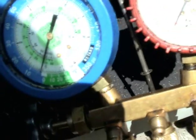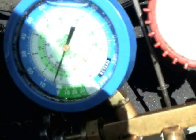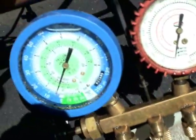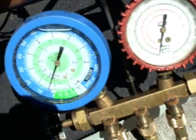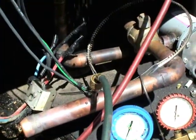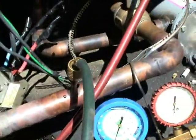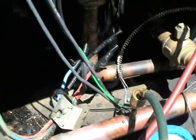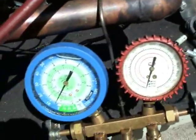We're almost there — there we go. Now we do have a positive pressure in the system, and about 2 PSIG is what most manufacturers recommend. Then we'll close the nitrogen tank off and let the nitrogen stand in the system for an additional hour. The nitrogen will have a good chance to absorb moisture throughout the system.